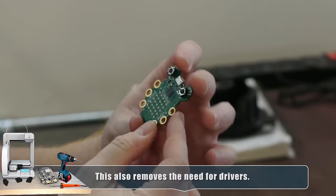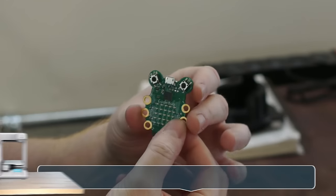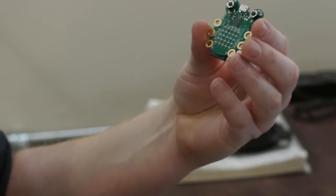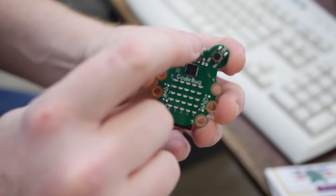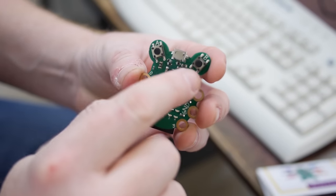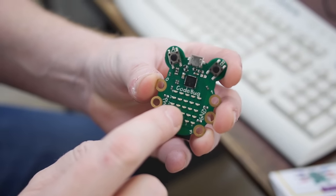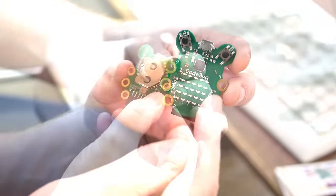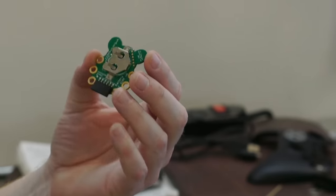It's intended for kids. It's got these big easy clips. You don't have to solder anything. It has a Microchip PIC on it — I'm not sure exactly which one, I guess we'll find that out later. It clearly is a chip that has a built-in USB interface because there's no other serial adapter chips on it. Basically the only thing on it is the PIC and some passives. On the back, there is a coin cell holder, so you can make a portable application.